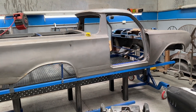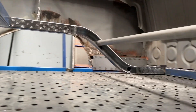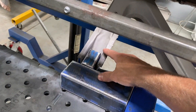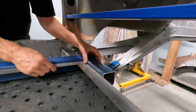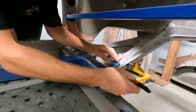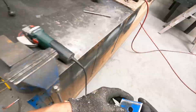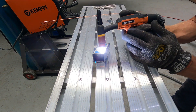After the rails were fully welded in, I positioned the car over the table then slid the rails in and fixed them in place. Next I cut the outriggers and cross bracing and tacked them together. The final thing to do was fabricate the chassis mounts where it bolts to the K-frame.